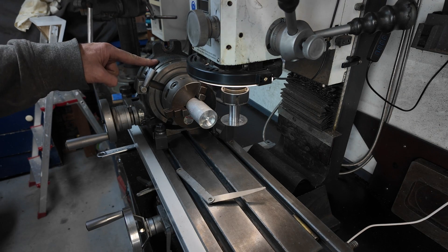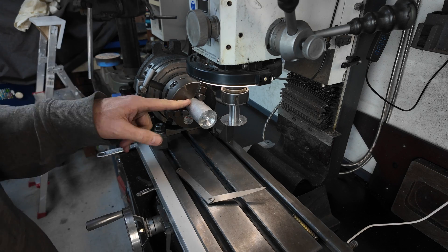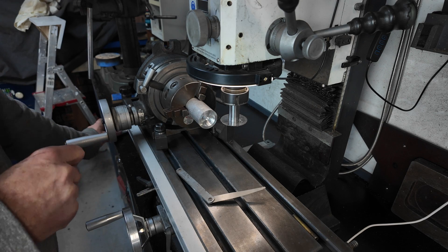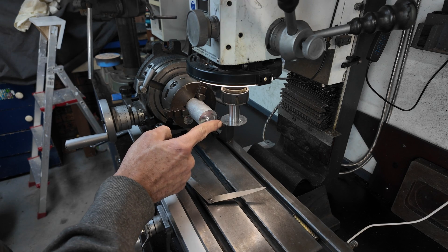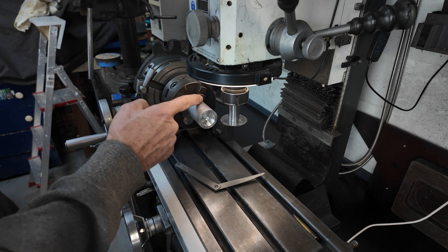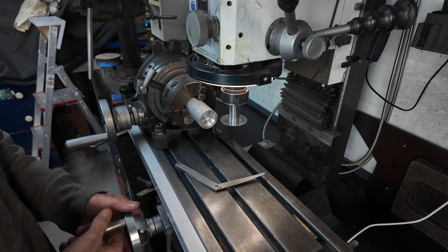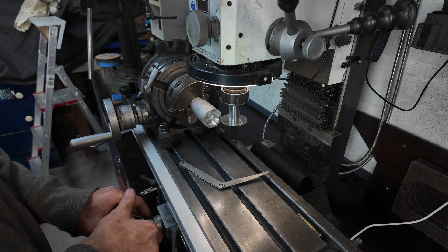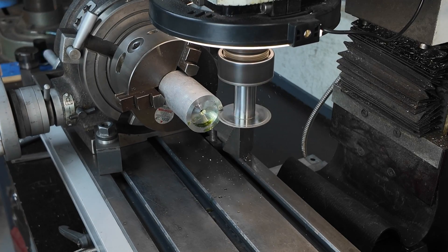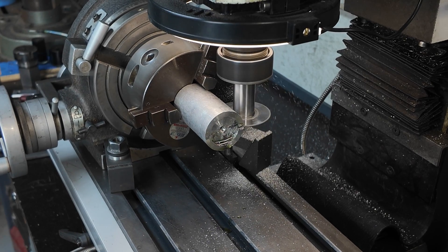Here's the setup. We've got the rotary table set up with the chuck straight from the mill. This is dead centred — zero is against the edge. We're going to go in 12mm in that way and cut to the end of the chuck, so it will go in about 11mm. This solid carbide slitting saw makes short work of pretty much anything, so aluminium is no problem for it.